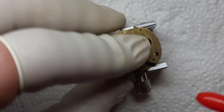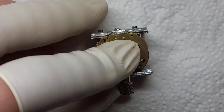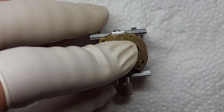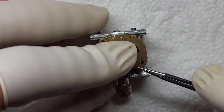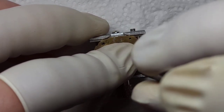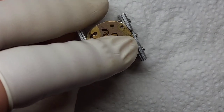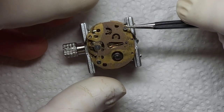I'm using an air jet - something I've seen other people do and I'm a big fan of it - just to make sure that balance wheel is spinning freely back and forth. Now it's in, and I don't want it to move, so I'm going to drop in a couple of these screws. As I said, it was very economical with its use of screws - one screw does multiple things. I'll get them in now just to make sure the pivots don't go anywhere while I assemble the rest of the watch. That's an old trick I've been taught - I'm an engineer by trade.